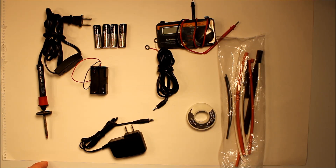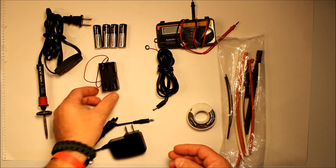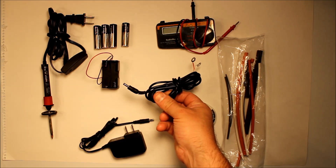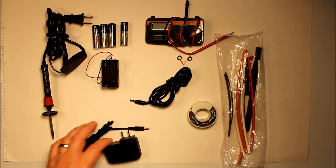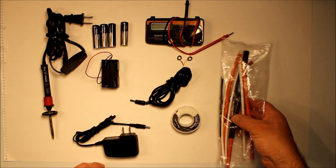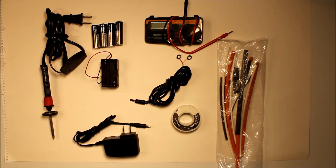Here are all the things we're going to use to create this external power pack for my video camera. I'm going to use a four double-A battery holder — I'll put the link to get that from Amazon. I'm going to use a soldering iron, four batteries, an identical cable to the original power source cable, and a meter for continuity testing. I also need a little bit of solder and some heat shrink tubing.